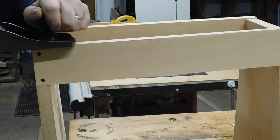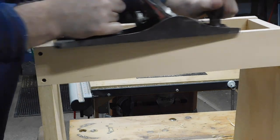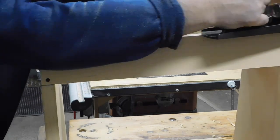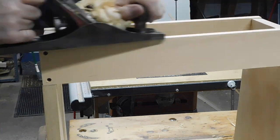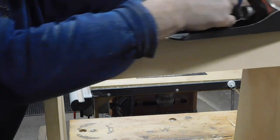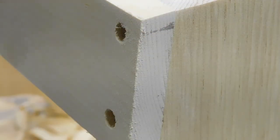Once you've got it all screwed together, you'll find that the edges aren't quite level with the ground or the top as you're going to need it. So using a hand plane here to shave it off so that it is level and flat and beautiful is probably the easiest way.